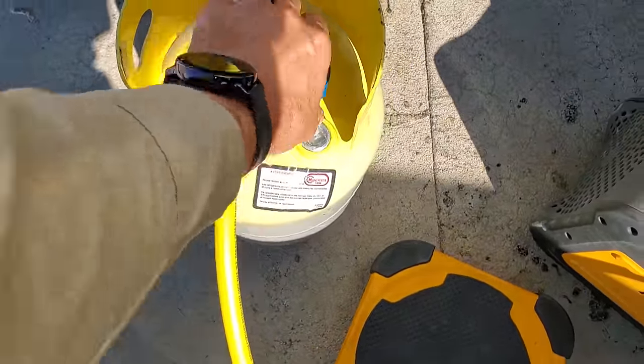I am very happy with this unit right now. Subcooling is falling in line. Superheat is extremely high, but again, we have a pressure limiting expansion valve, so that superheat number is skewed. My return air temperature is insanely high. Notice my targets are supposed to be really high. I'm okay with everything going on here right now. My approach temperature is actually a little bit high, indicating an undercharge, but it's not undercharged, trust me.